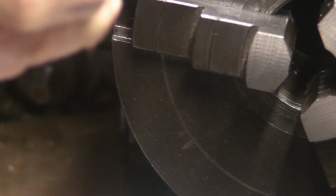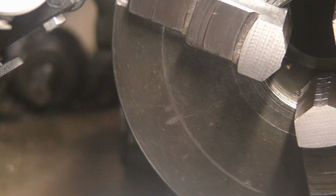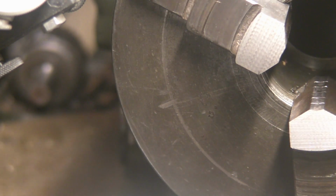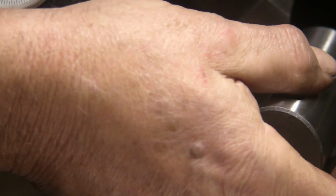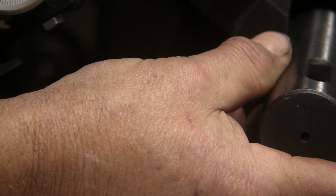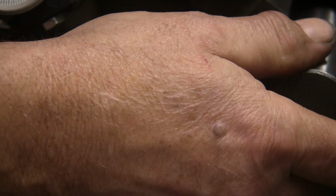Now, the larger one, when you open the jaws up to accept that piece, what I'm thinking is that it's only going to be the two outer points on the jaw that grip the workpiece. The dead centre won't be actually touching the workpiece. If you understand what I'm getting at there. Anyway, let's try to see what run out we've got on this one.